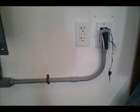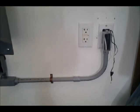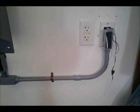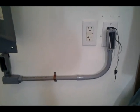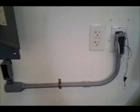I had to wire the 30 amp breaker, and I came out the bottom. I'm now installing conduit on my wire that's going to go over and out through the wall to the outside of the house. I'm going to install a receptacle on the outside of the house, which I showed in the first video. Then I'll put a plug on the end of the generator cord, which we'll plug into that, and then the generator will feed into the panel. I put this conduit in — it's about a half inch to 9/16 inch schedule 40 conduit.